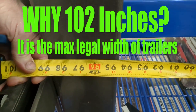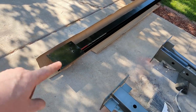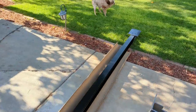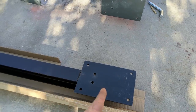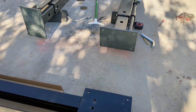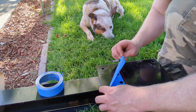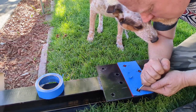Right now it's about 94 and a half inches - we'll call it 94. I need to add eight inches, so I need to move the beam four inches in on each side, which still puts the end of the beam over the center of the upright. Move those down four inches, move those in four inches, and that'll put me exactly where I need to be. And if I ever want to go back to the original width, I can just move it back.